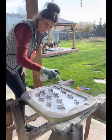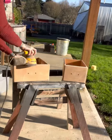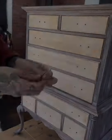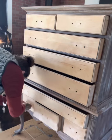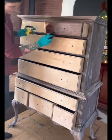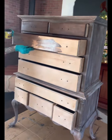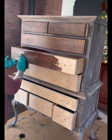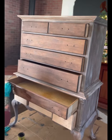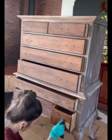I used a metallic silver paint by Rust-Oleum and painted all the hardware. Then I had to sand down some of the drawers so they would fit — just a little too big but not big enough to cut. Here's a little tip: once you put all your drawers in and they're stuck, take two screws, stick them into the holes, and you can pull the drawers out without panicking or prying. Then I'm going to use my English chestnut on the drawer faces, being really careful not to let the stain run over onto the sides. I also stained the top edge of each drawer since you can sometimes still see that part.